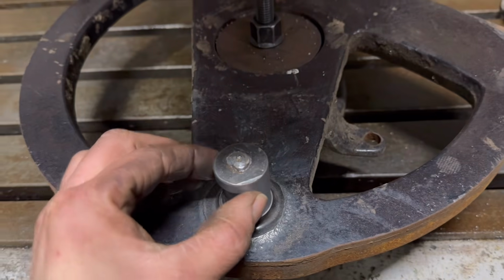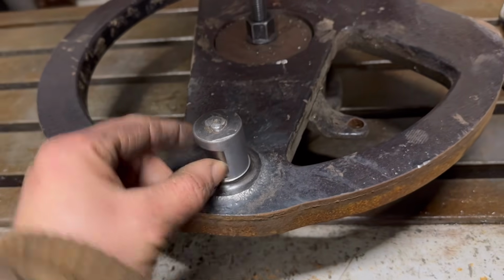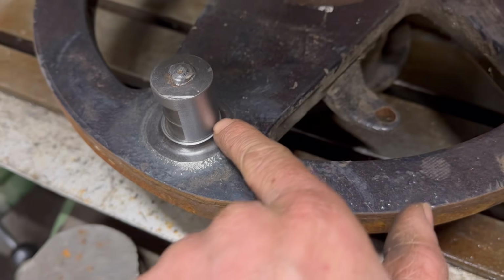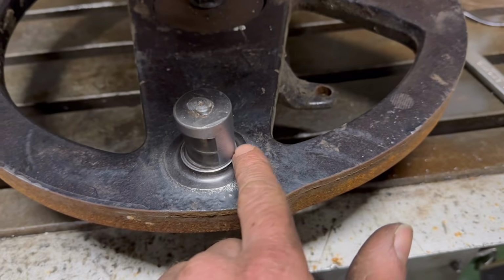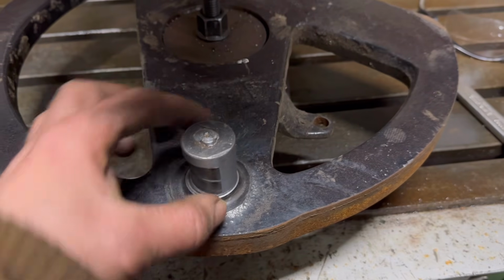Right, so that's got that down to 28 mil. Obviously it hasn't where that bit is, but that should give me like 1 millimetre of weld on the good side and then build that side back up. I don't really want to take any more off and weaken it too much, so hopefully 1 mil should be enough.